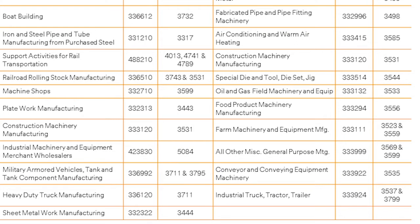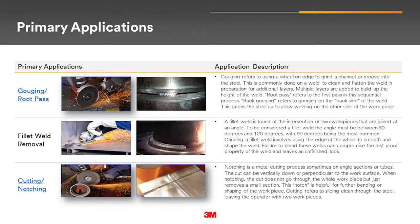These are traditionally more price-sensitive markets. Why would a customer use a cut and grind wheel instead of a depressed center grinding wheel or a cut-off wheel? It goes back to the customer's applications — it's optimal for back gouging, root pass cleanup, or fillet weld removal. A second type of customer needs a wheel that can do a combination of both cutting and grinding. Cut and grind can run on its edge like a cut-off wheel at 90 degrees, or on its face like a depressed center grinding wheel at 35 degrees.